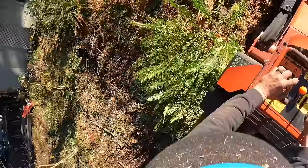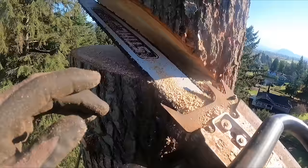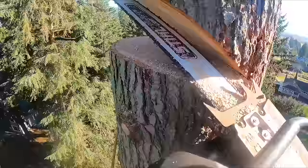How'd that feel? Perfect. Like me and Kevin got the whole thing. Go ahead and fall the tree, I'll pick it up. But another thing you'll see is like I'll cut it when I make my kerf, I'll actually pop down. I'm actually peeking through the kerf before I start my top cut. It helps light it up really well.